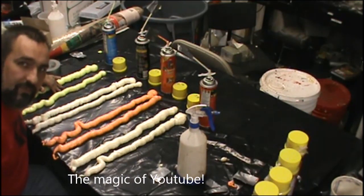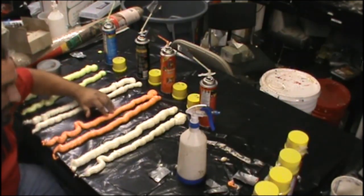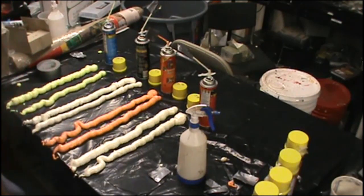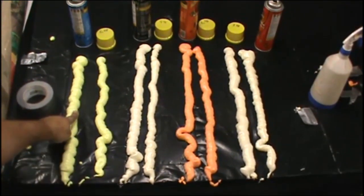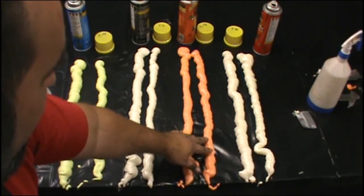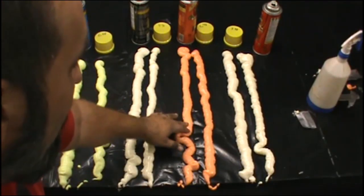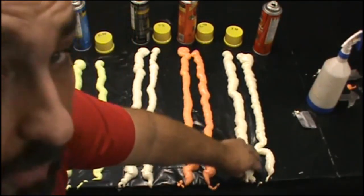It has been about seven minutes and the wet foam is pretty much completely cured. The only one that's not all the way cured is the Fire Block. And if you notice, the ones that I wetted are actually puffier - the side sprayed with water is much puffier and bigger. The Fire Block shows the least difference, as the additive doesn't make it puff out as much when you use water to speed the cure. The cheaper Great Stuff is really puffy.